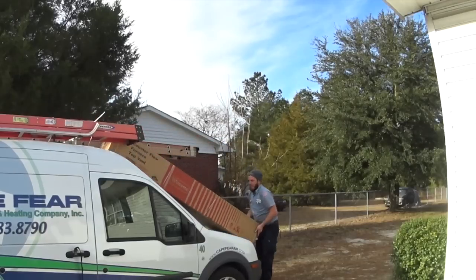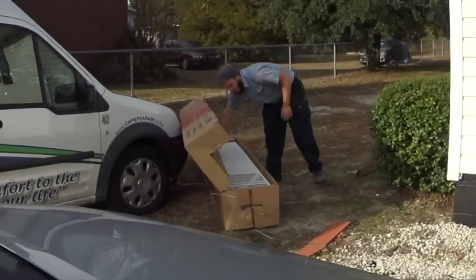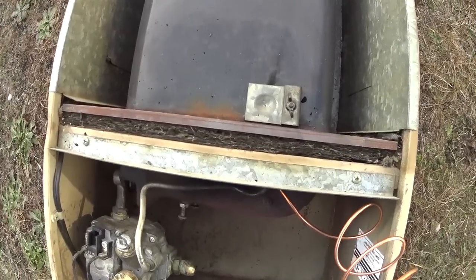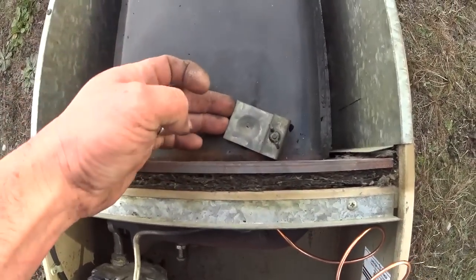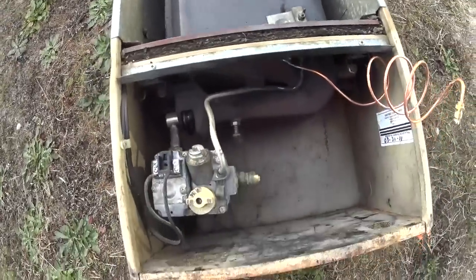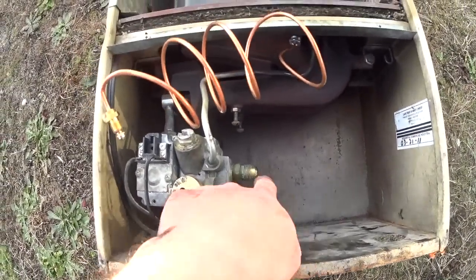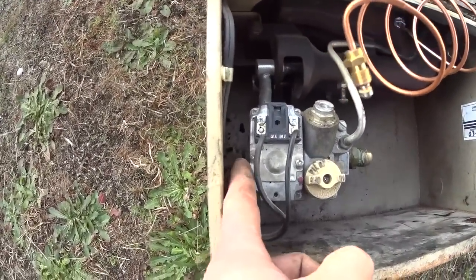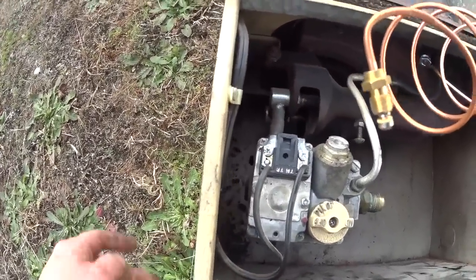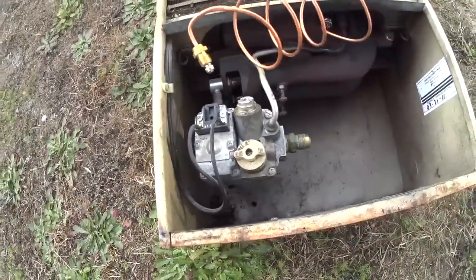Alright. So let's look at the anatomy of this unit. This one has a pilot lighting door here. It's not visible when it's closed. Got a pilot, of course, pilot knob, and two burners with a gas inlet. And then your pressure tap for the outlet gas is actually back in here, and you can't get to it, at least not once it's installed. I mean, I guess you could drill a hole in the side here and get access to it there, but at this point that's hardly worth the trouble.